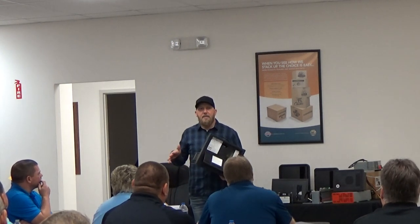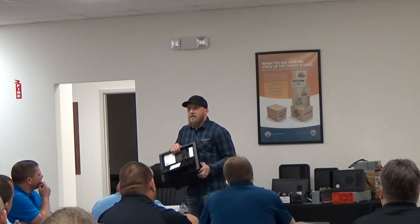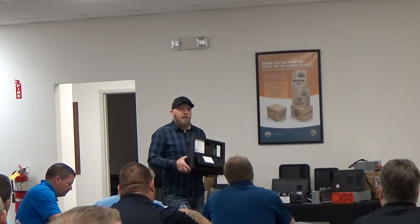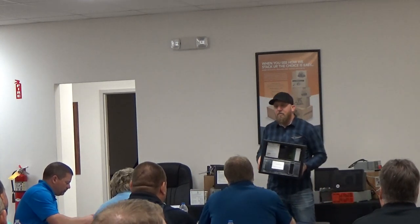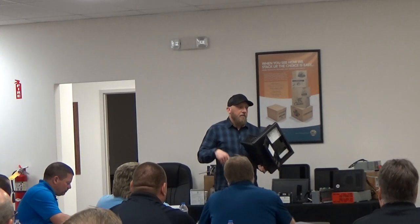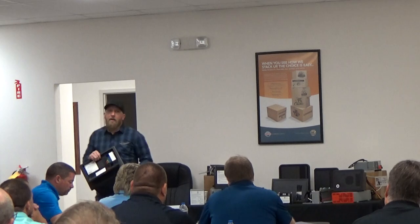Or with some of the heavier loads like hydraulics, leveling systems, slide outs, anything that has a high amp draw, instead of putting all that stress on just the converter, the battery is there as kind of a booster to help get those out without stressing the converter so much, because some of those hydraulics pull 100 amps. So this would be overloaded since this is a 55 amp converter. You'd probably see your lights dim down, and they'd be dim until you release the button, and then everything would brighten back up. But batteries are not required, though we do recommend them.